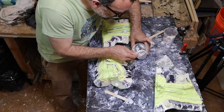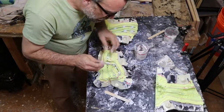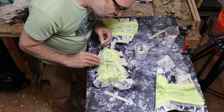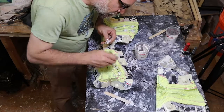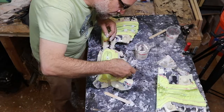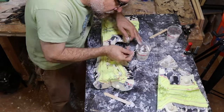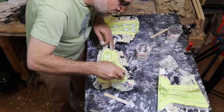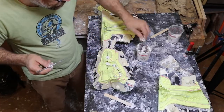You make these little stanchions by mixing some water and some plaster a lot thicker than you would normally mix plaster. I basically mix up a paste and then make these little towers — a little blob in my hand, put it in the mold, set the all-thread into it, close off the top to get it to stay, then carefully carve down the sides so that when I backfill it the plaster will flow through all of those parts. Otherwise it'll get jammed up and you won't get a good casting.